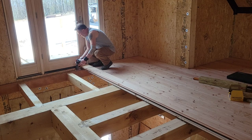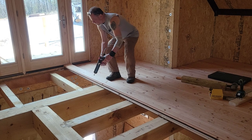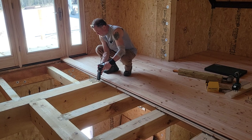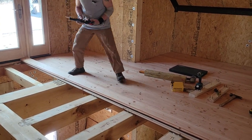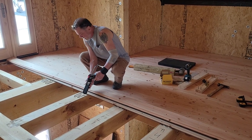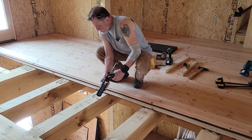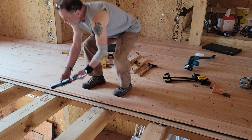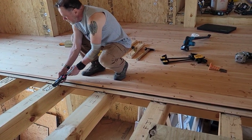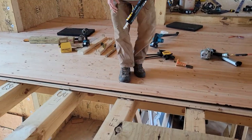Leave a good inch from the edge — especially if you're near a roof. When you tighten the boards down, you'll squeeze the glue out and mess up your nice ceiling. So if you get a big glob, scoot it to the middle, and try to avoid globs by not cutting too big a hole in the tip of your caulk gun.